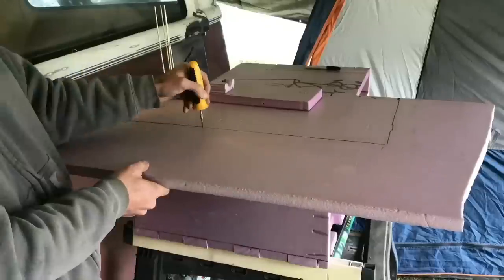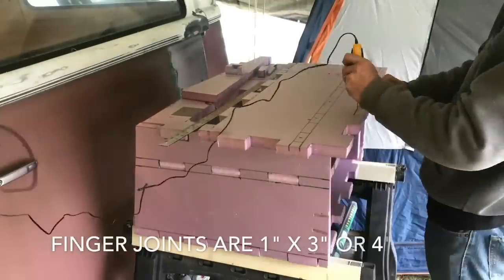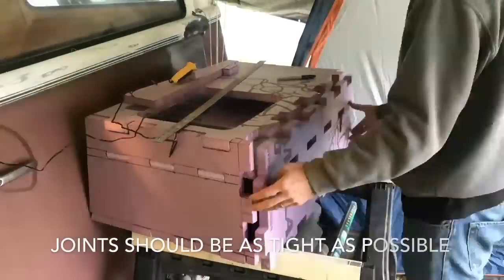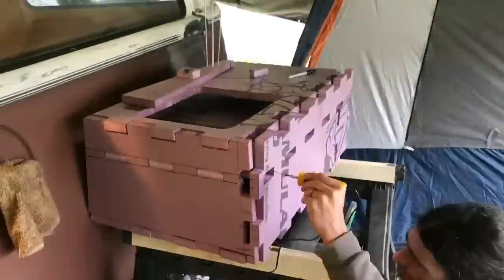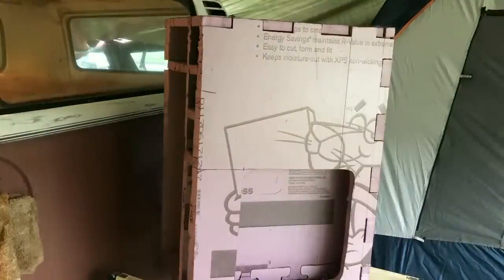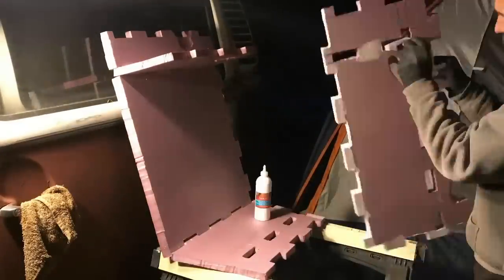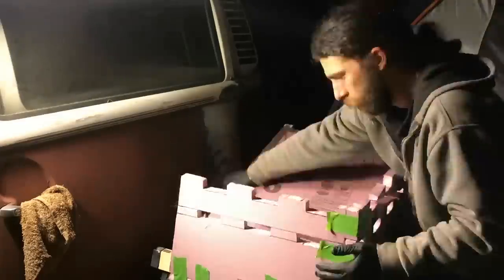For the finger joints along the corners, I cut them at a particular size and then measure and mark with X's the ones I need to cut out based on the mating piece. The last piece you put in is always the most complex, requiring lots of precision cuts to fit. Once I have that fit in, I also have three shelves that I'm putting in without tongue-and-groove or finger joints. That covers each facet of the sink unit cabinet — now it's time to glue it up. Just a thin layer of Foam Fusion on all touching surfaces is all you need. I put painter's tape on all the corners to hold those joints together while the glue dries.